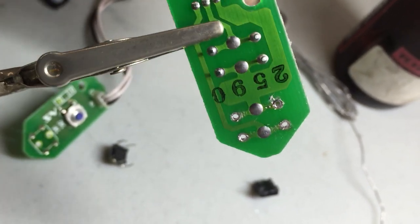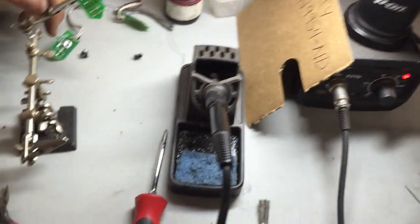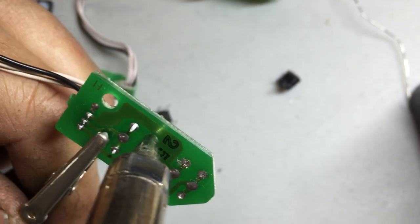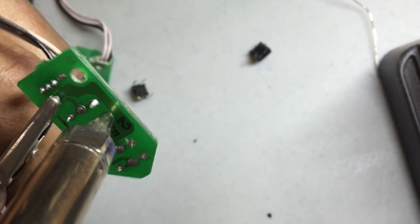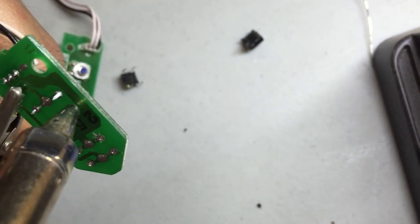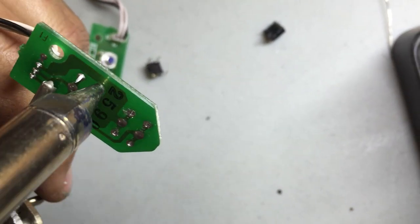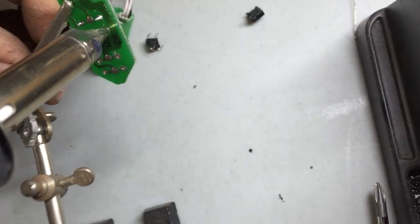You can see the holes don't have any solder in them. We have another tool also here — this is actually an electric de-solder gun — and we can actually put it on there and let it heat up. It'll heat the solder for a minute. You can pull the trigger on it; it's got a little vacuum in it, and it helps suck the solder out of the holes in it.